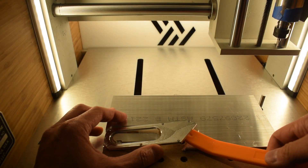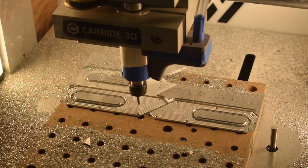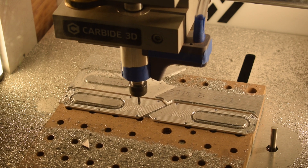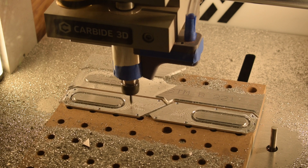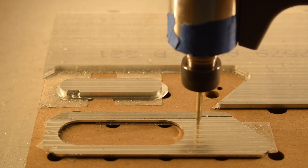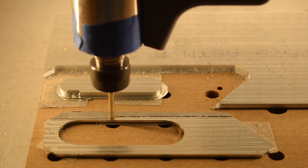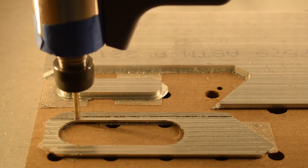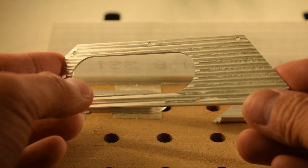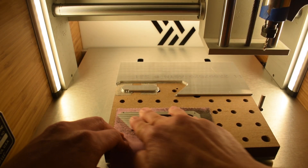Since these were so easy to run, I made a couple extra face plates in the background while working, coming back every few minutes to change tools. With my light finishing tool paths I was able to get some really good surface finishes, at least by desktop CNC standards. If I could do it again, I'd probably use the 278 quarter-inch single flute or even a six-millimeter Datron end mill — that extra rigidity and surface speed with larger diameter tools really helps on 10,000 RPM spindles.